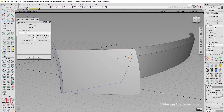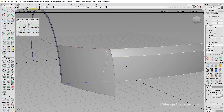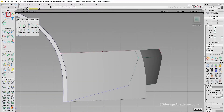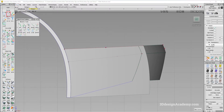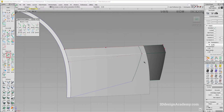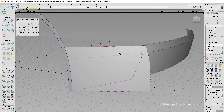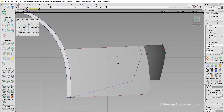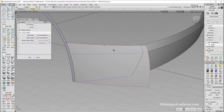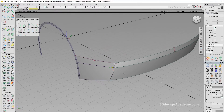When doing this kind of fillet washout, you just want to make sure that the edges line up. Right now this is just a single surface and there are two surfaces over here, so I'm going to split this one into two pieces. There are several ways to do this — you can use an insert or you can just project a curve. I'm going to use the curve I just created, project it like this, then grab this one and this one and say divide. I'll get rid of the extra surface and now all the primary surfaces are set.